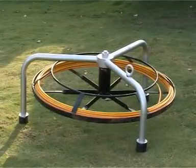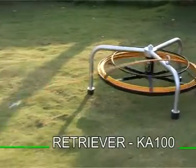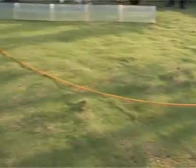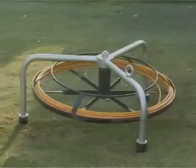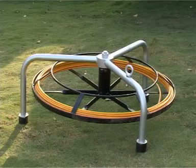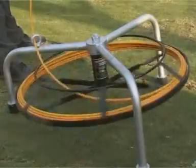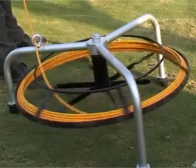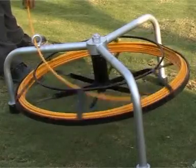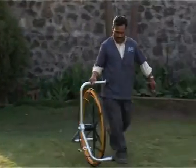Presenting the sewer man's favourite, the Retriever. This unique self-propelling flexorigid rod has been extensively used nationwide for removal of blockages manually using force. This unique flexorigid material is wear resistant, corrosion resistant, and therefore can last for an extended period of time. Its self-propulsion feature enables us to wind over 100 feet of this rod within a wheel cage, which is not only easy to store but easy to transport too.